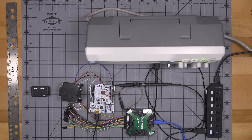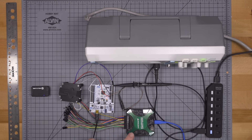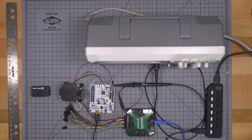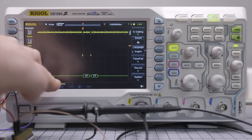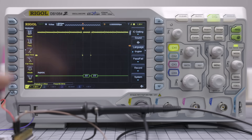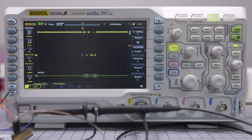Now I'm going to check and see if the speaker and microphones are working as expected. I've got the scope still hooked up to read the serial data, but now I've added this Analog Discovery 2 instrument, which will feed the speaker with a specific frequency. At 440 Hz and even at 2000 Hz, it's still so loud it's just saturating the microphones. I actually have to go all the way up to about 40 kHz before I start seeing signals that don't saturate. I'm not sure that this is a problem though, because I can still use this speaker as-is to verify that both microphones are working. I don't have volume control because I'm using a full H-bridge to drive the speaker — I could try to get a little quieter by switching to a half H-bridge, which I might do.